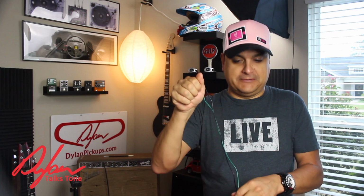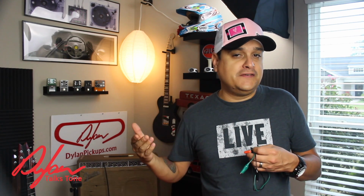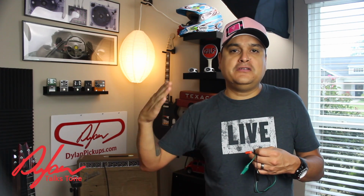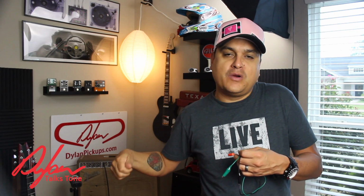Now if you leave those hooked up to your guitar, then you can easily swap out capacitor values, those four different ones that we left in the test kit, and you'll easily be able to tell the difference between the tone. What's interesting about it is because there's resistance to the tone pot, either 250K or 500K, there is a little difference in tone even with it all the way up. And then you'll also notice with it all the way down, there will be a big change. And then you'll also be able to notice the curve from bottom to top, how it affects that curve, like how much it affects and where it affects it.